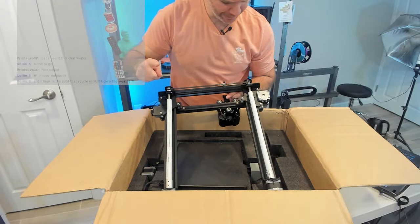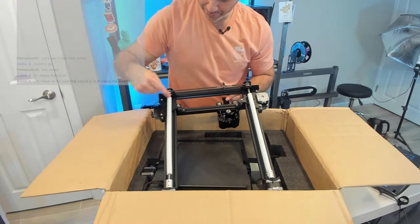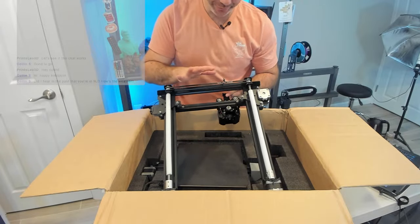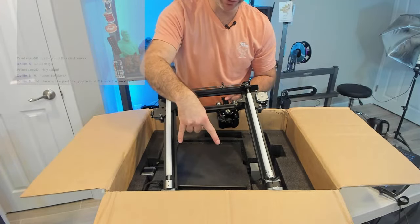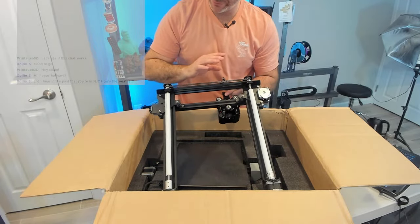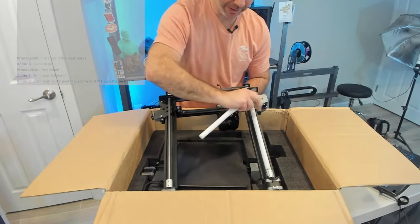So it's interesting. They have two motors, two screws, and also a timing belt to synchronize them. In general, you have one or the other. At least that's what I've seen. I don't know the reason to synchronize this with a belt if you're also giving the same current to the motors, unless we have dual stepper drivers. But even then, I think that's even more wrong. We'll find out. Interesting though.